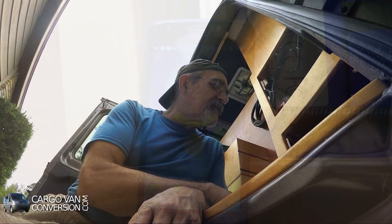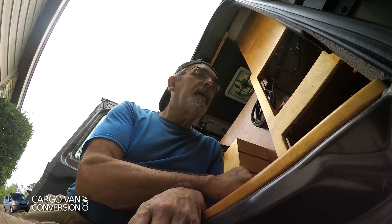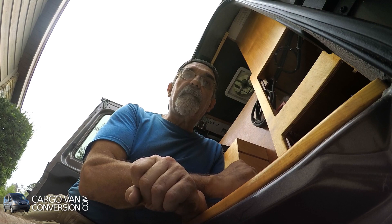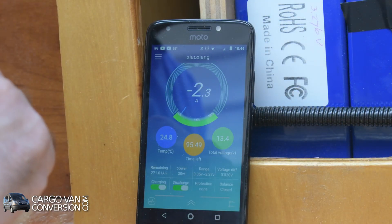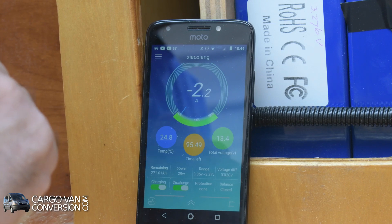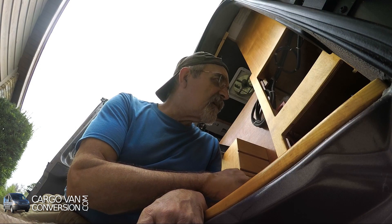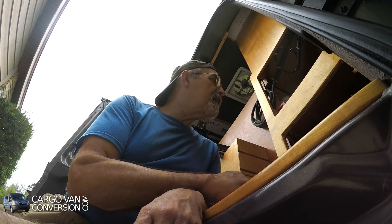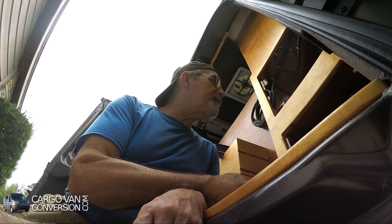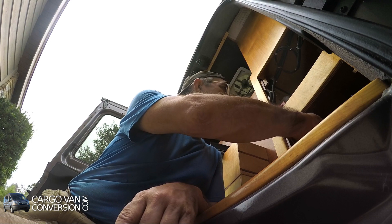I'll take my first battery — that's the one in the back that I already had connected. Then I'll connect my solar — it's charging, no amps to the batteries, which is probably correct. I reprogrammed my solar charger to not charge more than 80% into my batteries. For now nothing has blown up, everything looks well — I'll keep them connected and use it a bit more to see whether the cables are hot or not.